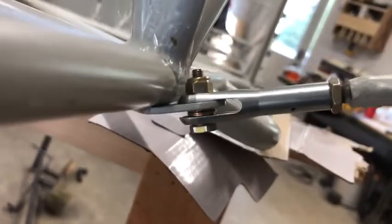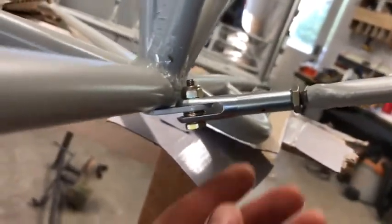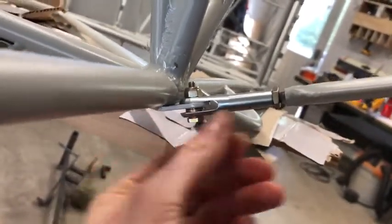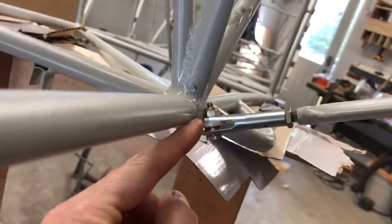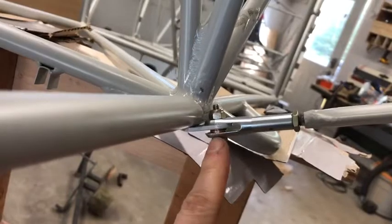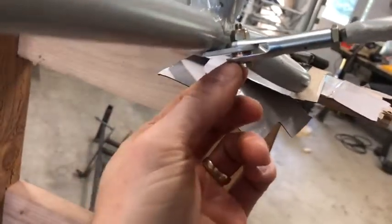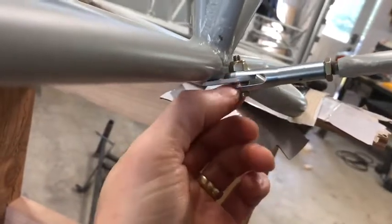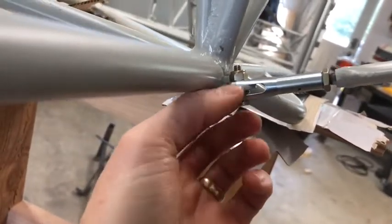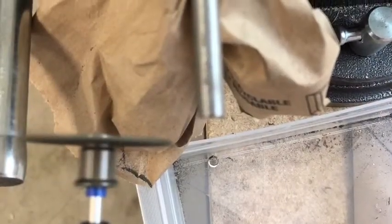This piece here actually has more parts than it looks. To make it all fit properly, you've got AN-4 size holes in your clevis fork and an AN-3 size hole here. You can either drill that out or put bushings in the clevis fork — I chose bushings. There are tiny little bushings in there, along with the bolt, a thick and a thin washer, and then your nut. There's quite a few pieces of hardware in this little spot, and there is supplied bushing material that is perfect for this job.